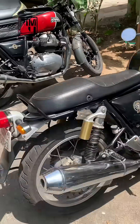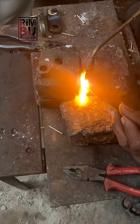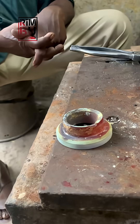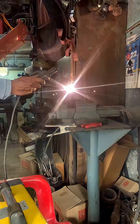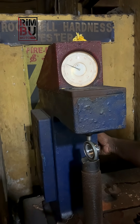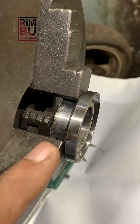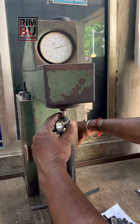I did this experiment to show everyone what can go wrong when welding on a fork cone or bearing area. We brazed one side using gas welding and used arc welding on the other side. The arc weld cone had a hardness of 40 to 50 RC. The gas weld one was even lower, only 32 to 38 RC. To confirm, we checked again at another company and the readings were the same.